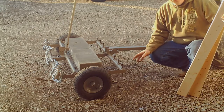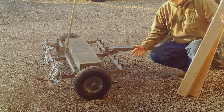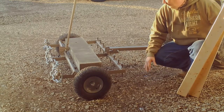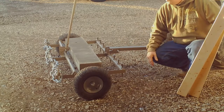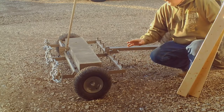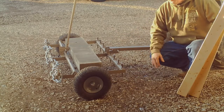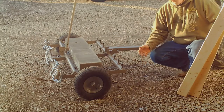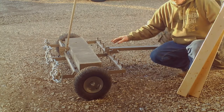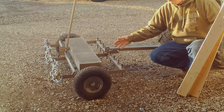This also is a cultivator, so you can use it for gardens and food plots, whatever you need a cultivator for. But it works really great on lanes. It's just this design, and it'll really dig in with 3/8, 1045 carbon pins. It digs in nicely with the weight here, depending on how loose your soil or your gravel is. You might not need the 2-4 inch solid blocks that I have. You might want to adjust it.